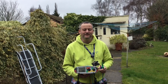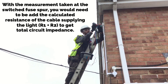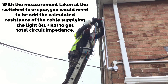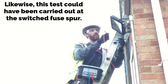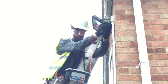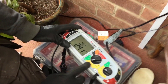Let's see Jack do the test if he doesn't get camera shy. I'm just doing a three-lead low test with a reading of 49.9 ohms. I've then removed the middle lead so it's just line and neutral to do a two-lead high test, with a reading of 0.36 ohms.